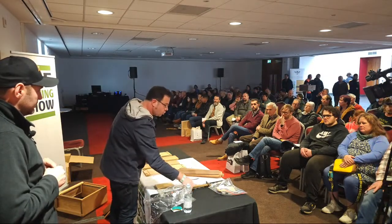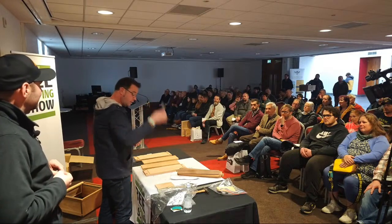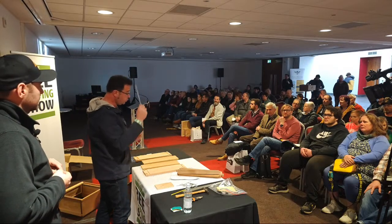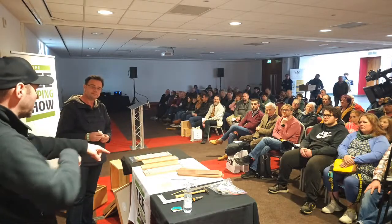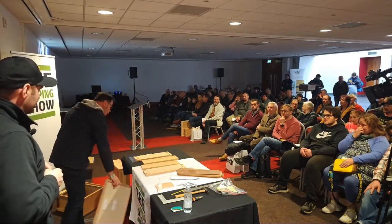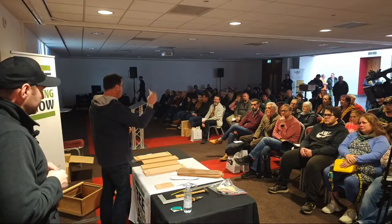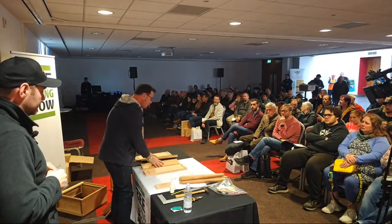Make sure you've got all your tools: a hammer, a small pair of pliers, a pencil, and a square - it's very important that the finished hive ends up nice and square. If you haven't got a square, you can check by measuring the diagonals - if they're the same length it's square. An even simpler way is to use a crown board from another hive as a square reference. You also need exterior grade wood glue - it comes with the Thorns pack.